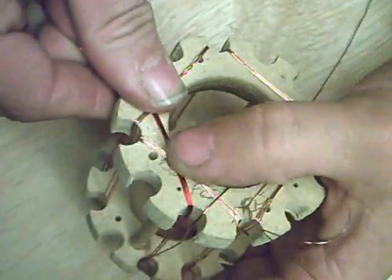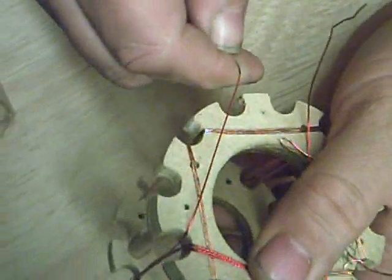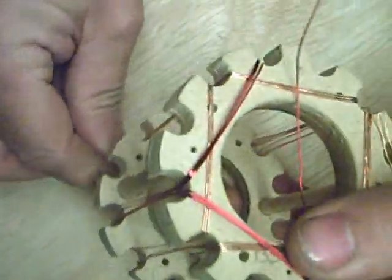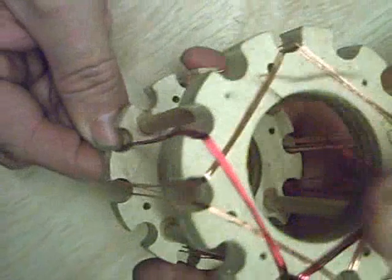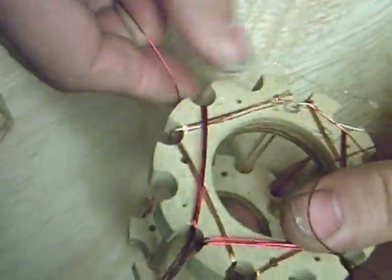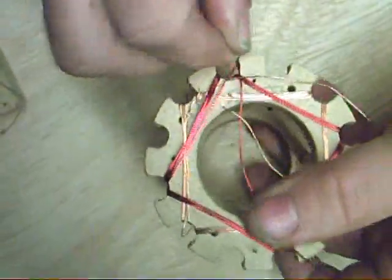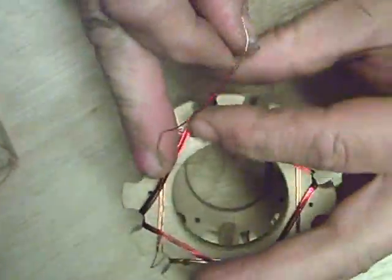When you come back up — so in other words, we've done 50 turns, we've come back to the top, and we've just done those clockwise — so now this 50, or imaginary 50, would go anti-clockwise. Now we've come across the bottom, missed two, come back up, and we're now going to go clockwise. Then we go back up and come back anti-clockwise to finish phase two, meaning we finish back in the same place as the other one.